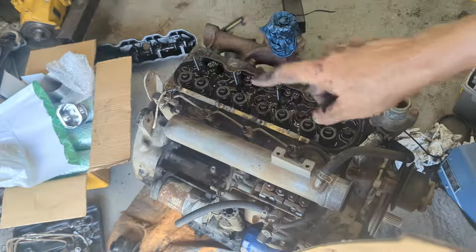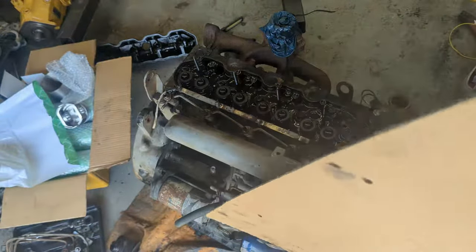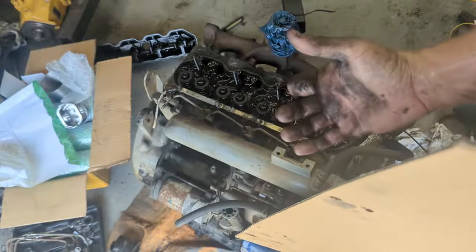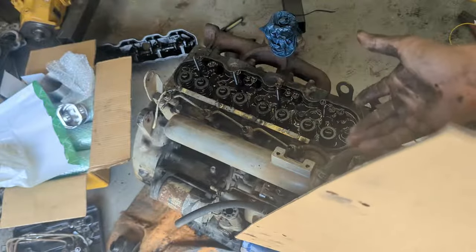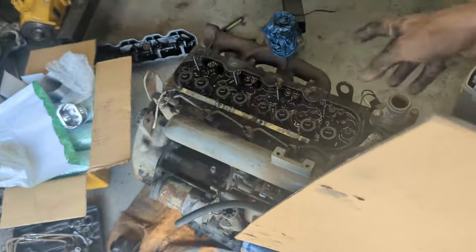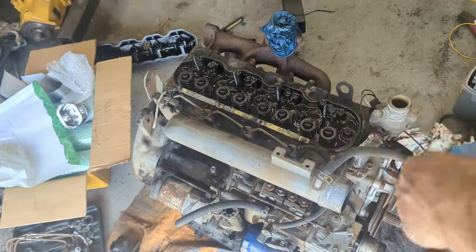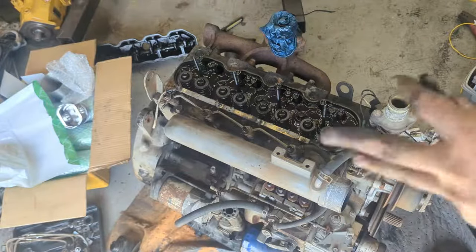And with the pistons, you also want to keep the direction the same. Typically there will be a marker on the connecting rods, and when you go through the manual specifications, they'll tell you which side the markers are on. But other than that, that should be the only thing that's important in keeping everything identical.